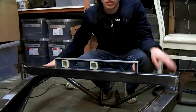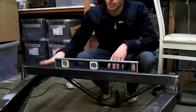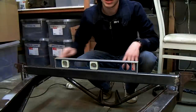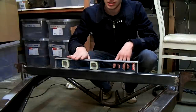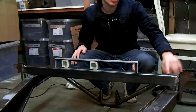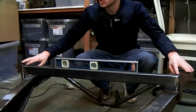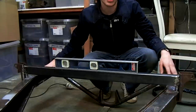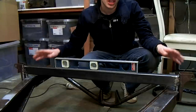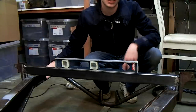I've put the chassis on the ground to make sure everything was stable before welding in the crossbar. I've put some sockets on both sides to act as spacers and used a level to make sure everything was straight. I've tacked in the crossbar to the shock mounts on the tops and the sides to minimize warping. Now I'll take the crossbar off the chassis and weld everything on my workbench.